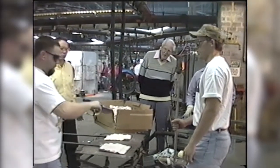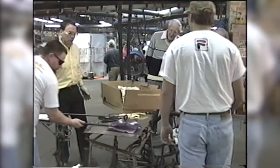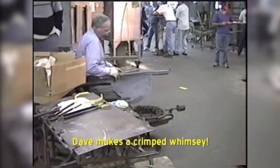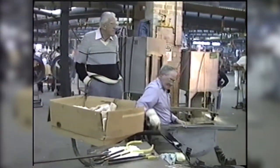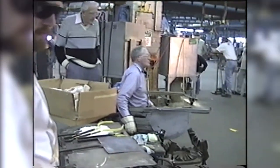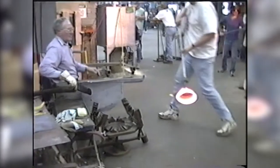When I asked Nancy if she remembered anything about this particular piece, Nancy's my wife who worked at the factory for 30 years and was head of design, she said Frank told her that it was very difficult to anneal. The stresses that you have inside the piece, you need to cool that glass down so that what happens, the outside cools, the inside's still hot. As the inside cools, it shrinks and puts pressure on the outside.